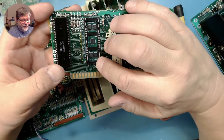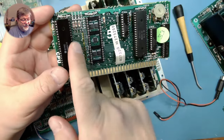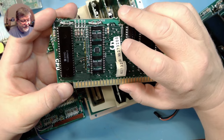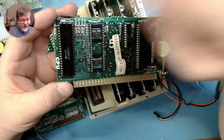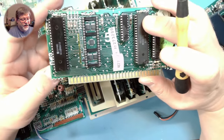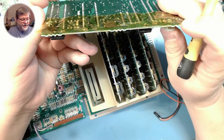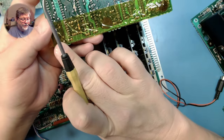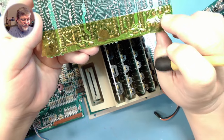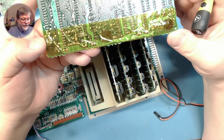When doing this, I don't think there was going to be an issue, but I put some Kapton tape on the bottom side of this board just to make sure that nothing shorted out underneath. I also put some Kapton tape over here to stop these connections from touching anything. Another thing that had to be done was there's a resistor right here and a resistor here that had to be moved to the back of the board for the GTIA digitizer to fit. Also, because of the depth I had to remove, there were three styrofoam pads that kept the back of the CPU board from touching the cast aluminum shell and shorting out — so I pulled those off to reduce the thickness and then used Kapton tape on the back to prevent the board from shorting to the aluminum shell.